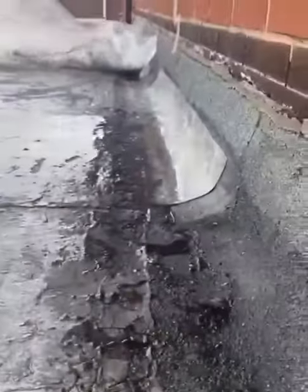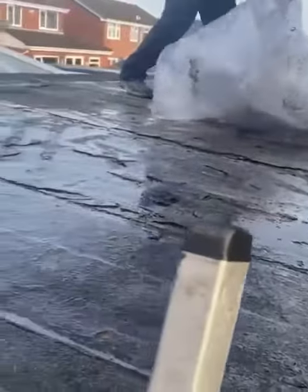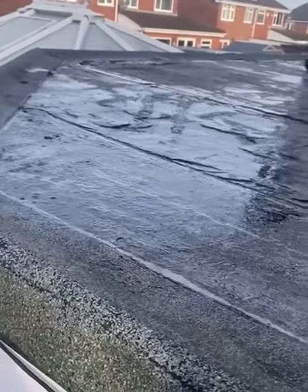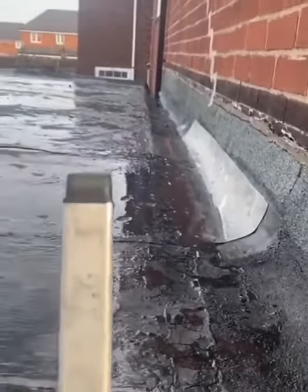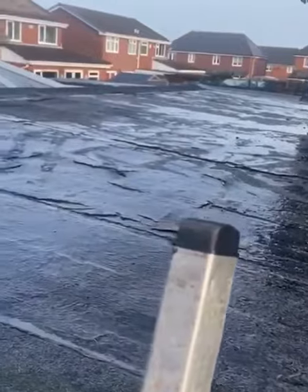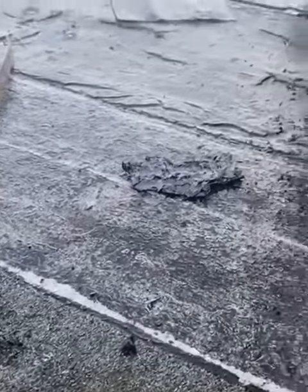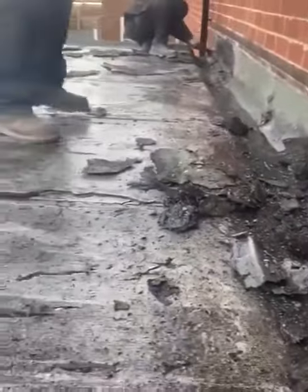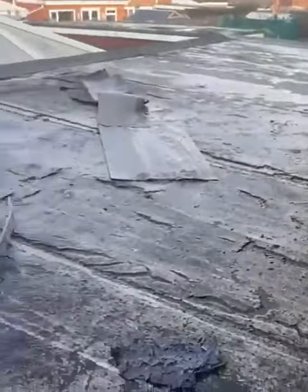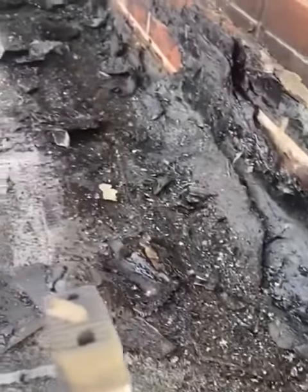Look at this — we've got water on the felt, the roof is torn before we finish. So what we're going to do is strip all this down, put a new ply sheet on — 18mm ply — and then bond the rubber roof on top. Why is this roof leaking? Look at all these cracks along here. So much leaking in there, that's why we're changing this. The rubber roof downstairs is pouring through.